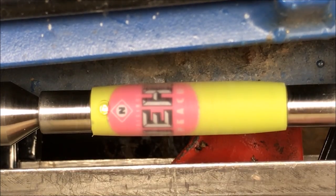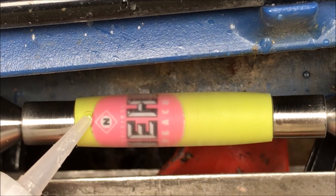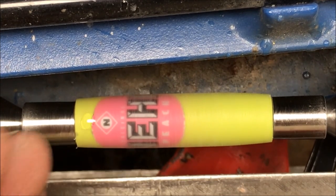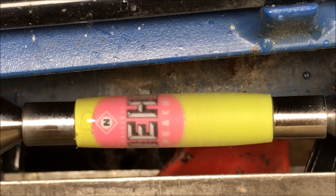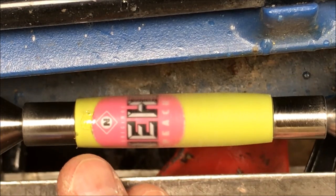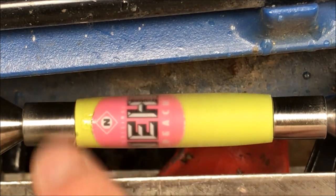I'm going to clean out the dust, use a little bit of medium CA, and put a dot right on it. I'll pour it in slowly so it fills — if you pour it slowly it'll sort of fill the concave area and usually won't leave any bubbles. If you glop it in there you can trap a bubble underneath. I'm using a little activator, shooting from a distance because you don't want to blow the CA out of the fill area. When you fill with CA it will dry completely clear and you should not be able to see that bubble.